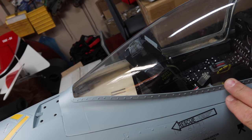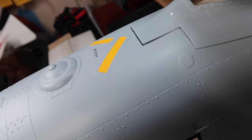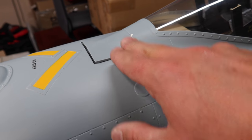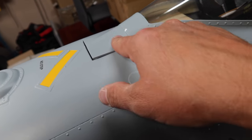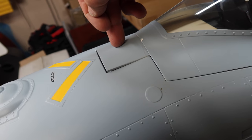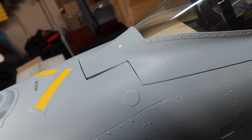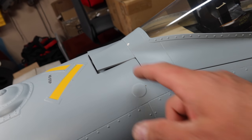With the canopy installed, this rear piece gets screwed in from the back side. I've been messing around with this little rear flapper for a while and I'm not overly impressed. If I raise it any higher it catches on the canopy; if I drop it any lower the canopy won't close. So I'm going to get rid of the attachment that connects it to the canopy and just put a little hole in the top and screw this piece down with an Allen key — that'll give a nice tight fit.